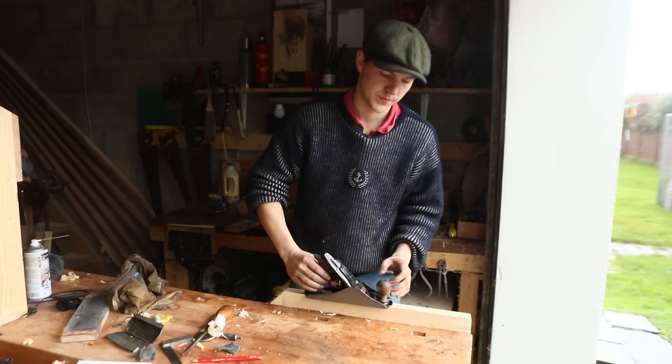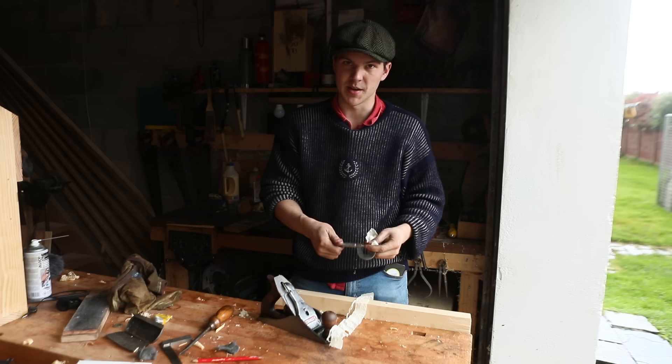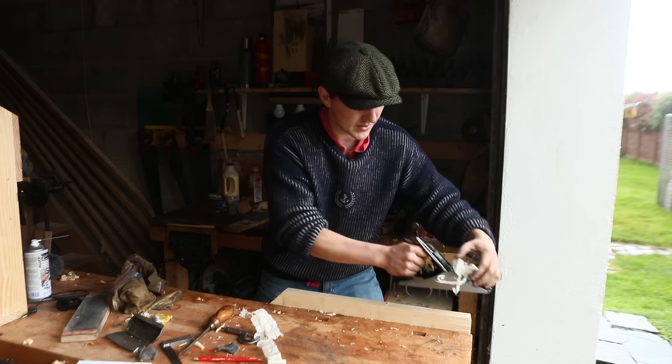I have a piece of spruce here and you can see we're just taking these beautiful shavings off it. I recently picked up a micrometer — it measures one thousandth of an inch — and we're taking shavings that are two thousandths of an inch thick, which is fairly good. There's another hand plane restored — I hope you guys learned something or at least enjoyed it. I'll be able to get this back to its owner now, thank god. Thanks for watching and I'll see you guys again.